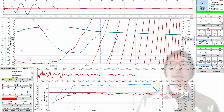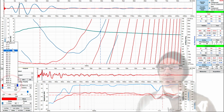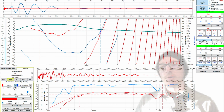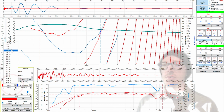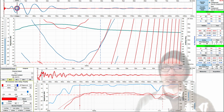So we know that the blue trace is a lot steeper than the red trace. And let's go back to our Linkwitz-Riley 24 where we just were. Let's turn that guy back on. Okay, that's not steep enough. So just for fun here, if we're starting with the phase trace, let's see if we can find a filter that is a better match for our phase. So let's go up to Linkwitz-Riley 36. Okay, and I can't see everything on the screen, so I'll adjust this reference.